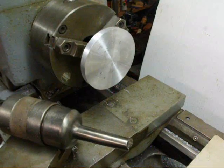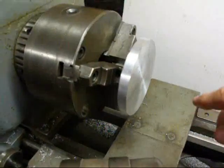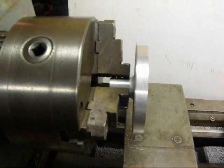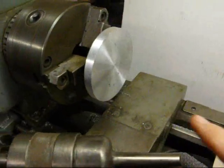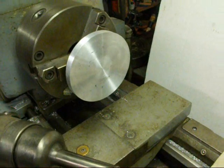In this part of the video I'm going to show you how to power ream a hole into this flange here that's being held in the three jaw chuck by a little hub, and we're going to ream that half inch diameter — power ream it.